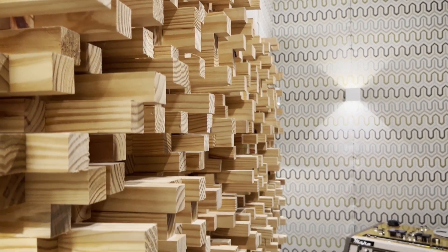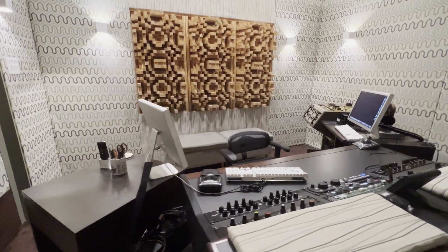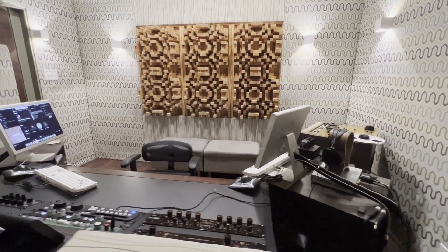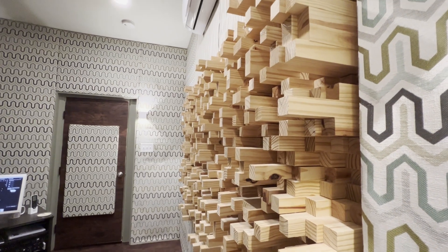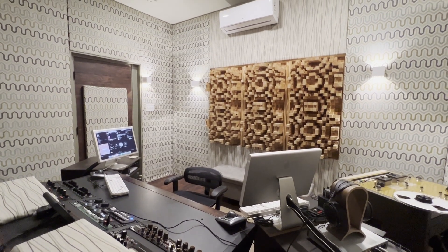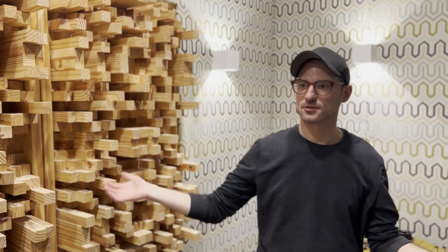Really, it's just taking care of roughly 4kHz down to around 700Hz or a little bit below — so it's taking care of all that flutter tone energy that could exist in the room. We do have a bit of drywall right above them, so it's really sort of mitigating that aside from the cloud. That bandwidth of the room is just calming the room down in that frequency range.